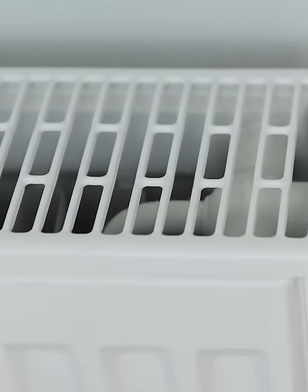The homeowner at this house doesn't like the city water — she's claiming that it's hard water. So the first thing we did was a water test. What we found is the water contains about 10 grains of hardness, and at that point you're going to start seeing the effects on the water heaters and other water-using appliances will start to scale.